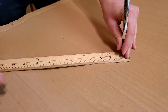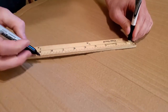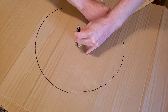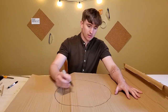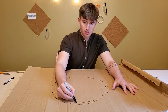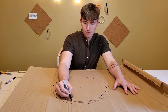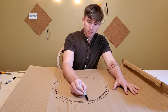To make a circle about 16 inches in diameter, I'm going to center this yardstick with a pen and then go to the eight and slowly draw it out. I also want to cut a slot for the chair back to fit in, so I'll just make a semi-circle, and then another one just inside of that, and we're going to cut out this portion right here.